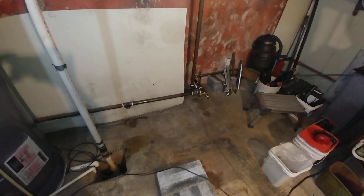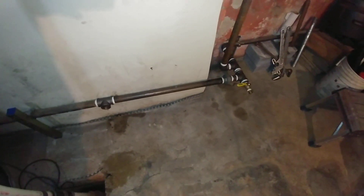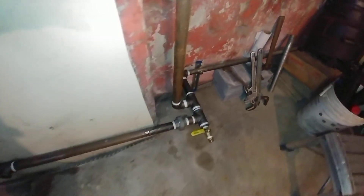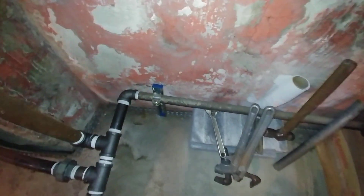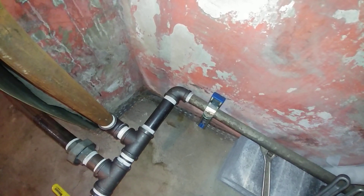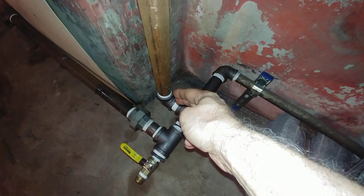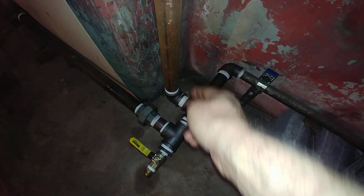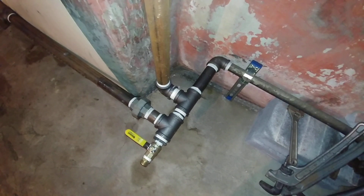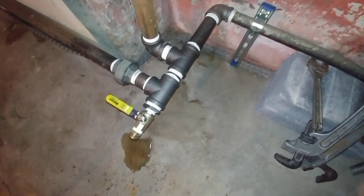Got another progress report here. As you can see, we've got the wet return complete. Here's our original one inch, and I brought it out as a one inch by one inch and a quarter. I got the dry return drip coming in with the inch and a quarter, which according to the charts is plenty big enough. There's my full port drain valve — still got water coming back from the system.